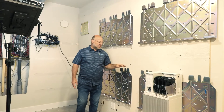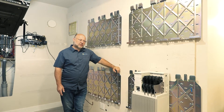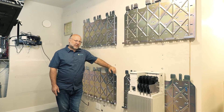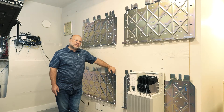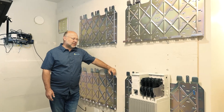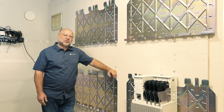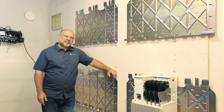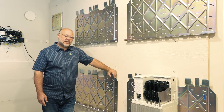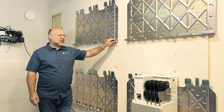There are a couple of appliances on my home service that are too large for these batteries to support, but the bulk of my home operation will be supported in an off-grid situation with these 40 kilowatts. My house consumes about 50 kilowatt-hours per day, and this 40-kilowatt system with the sun should last many days — if not all days. If I get multiple consecutive cloudy days there might be a situation where it won't fully cover me, but in most cases I think this will work. There's also a consumption planning and sizing tool on the web to help size the right battery system for your home.